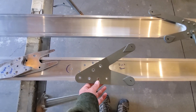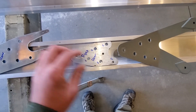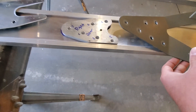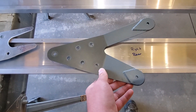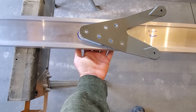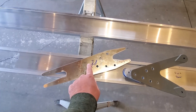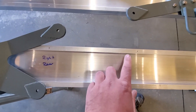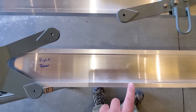In this lamination here we've got your spacer block, and this spacer block overhangs the cap of the spar a little bit. That's to prevent this weldment from chafing on the spar, and then of course this piece gets riveted to the back side of the spar. When you're drilling these rivet holes, make sure that you have bolts in all these holes. You can also see that the spars are pre-drilled for wing ribs on one side of the spar only — you'll have to drill the other side on assembly.